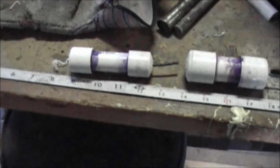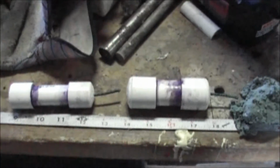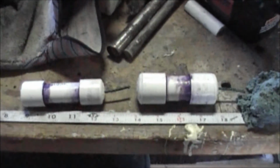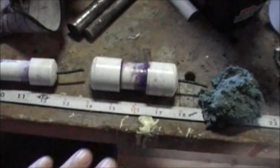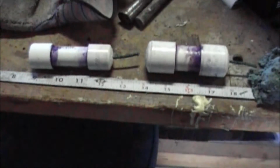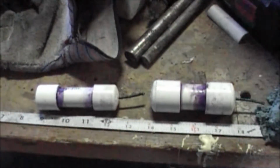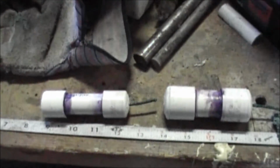My last two failed. They were packed powder, and I believe that the packed powder is going unstable when it gets over about 150-200 PSI. Last time this one fragmented into a million pieces, which indicates I probably hit 3000 PSI, but we're not sure. This time I cooked the fuel and packed it in there when it was still warm.